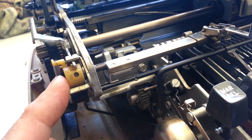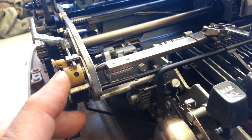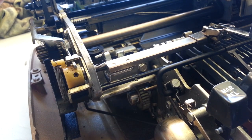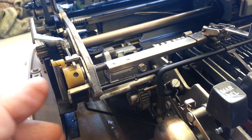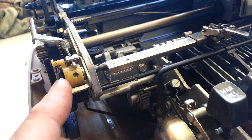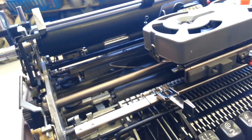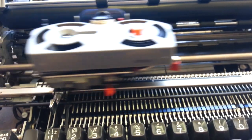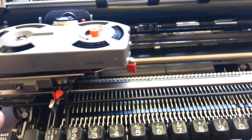I'll bet you I put a little lacquer right in here, manipulate that back and forth, maybe move the pitch like this, give it a little shot of air. That now — it's going to spring. See that? It springs back now, the whole thing moves back. That's what was causing the carriage not to latch up. So now I can almost guarantee that this will not do what it was just doing, because that part is moving freely now.